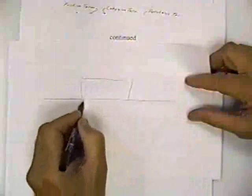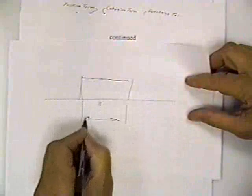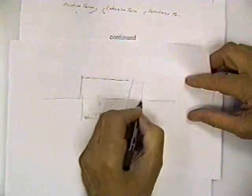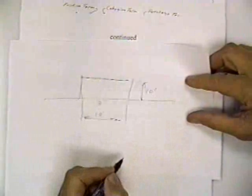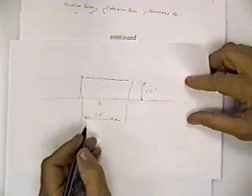If you were unloading several railroad cars of brick on the side of the railroad siding, and you had a saturated clay, and you said, "Holy smoke, I've got to stack this stuff up, but I wonder how high I can stack it. If I stack it too high, I'm going to get a foundation failure." So here's the ground surface, and this is B. Maybe you're going to stack this so your stack is 10 foot wide, and you want to stack those bricks about 10 foot high. And you say, "I wonder if it would carry it."